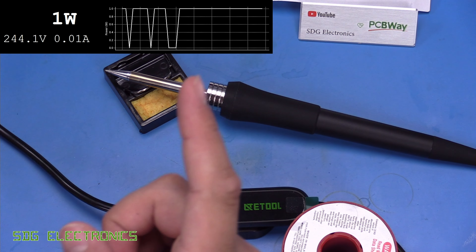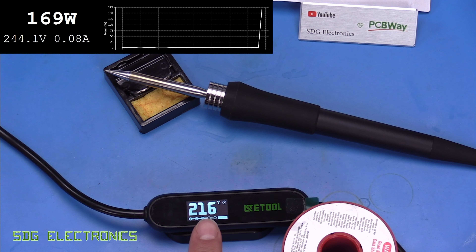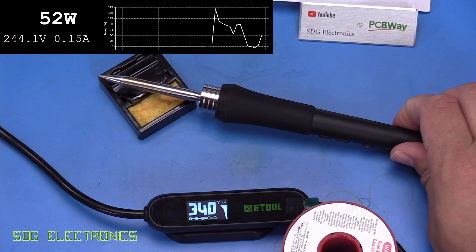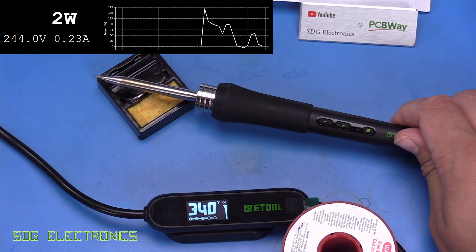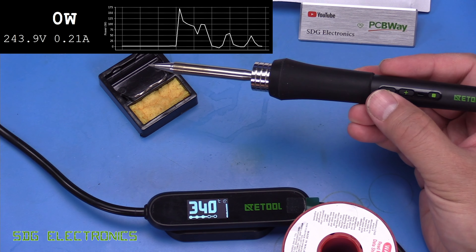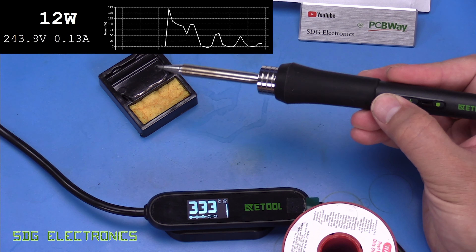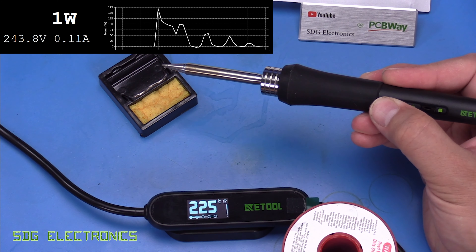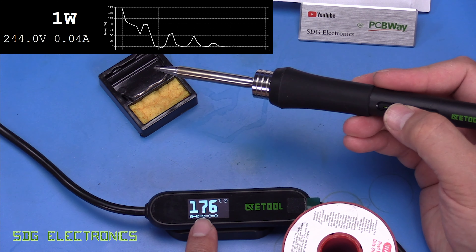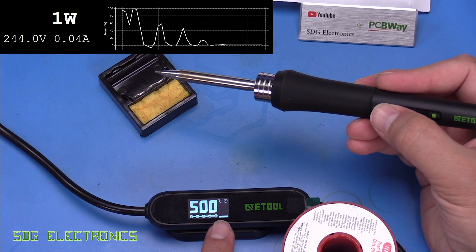Let's power this up, just taking note of the power consumption. Plugged in, we've got the menu and then the temperature climbing rapidly — I think we've seen about 175 watts for a moment there from the mains power supply, dropping down to a more reasonable 100 watts and then right down. We've got a little bar graph showing how the heating element is being driven, and that pulsing LED pulsing on and off every time the heating element gets power. The temperature is showing 340 degrees C and we can adjust in one-degree steps using the plus and minus buttons, holding down to go very quickly, up to 500 degrees C.